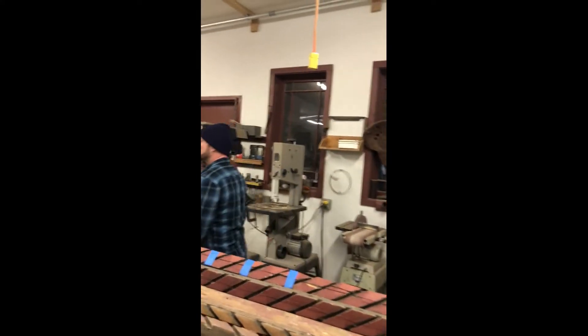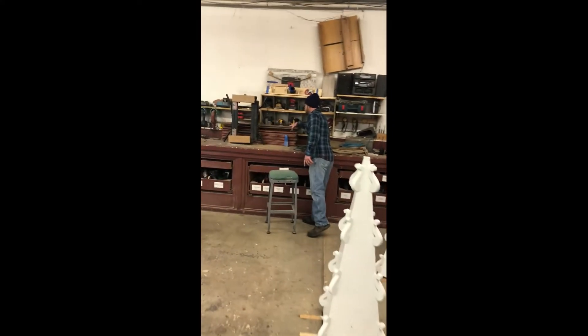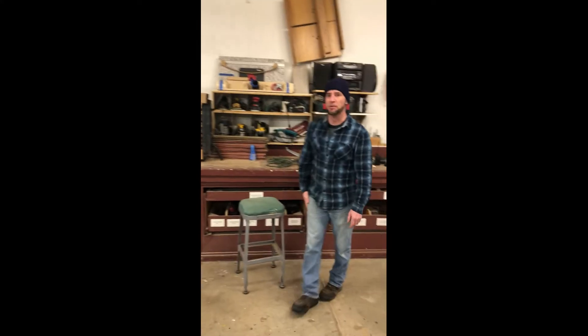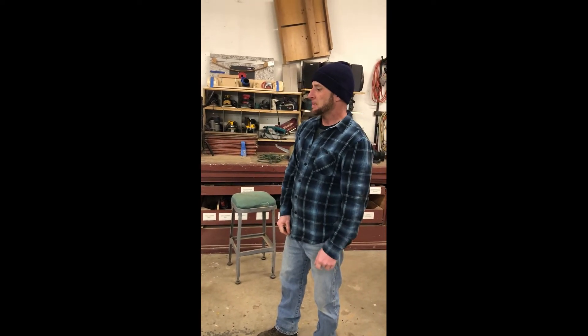There are other piles here where we've got some of the louvers that have been taken apart. We'll go through all of this, evaluate them, and put consolidant on it — it's a hardening agent if the wood is really soft, so that it maintains its integrity. Then let's go in and see the rebuilt ones.